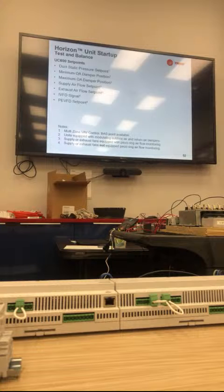I'm sorry? It'll be 100% or 50%. Or even smaller. So when you start even going to 20% airflow, you're going to crank that damper down even more. You could be down around 5%. So if it's 20% outside air, 80% return, 5% is what we typically see at that point.